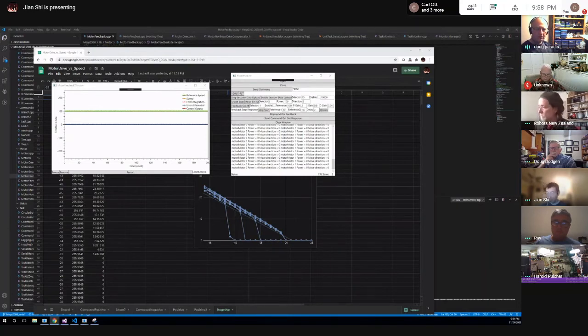So, there's nothing wrong with having four wheels and four encoders, but you're going to have a speed PID loop on each pair. Like, if you're telling the left side to go 100 and the right side to go 50 so that it's turning, you want both wheels on the left to go 100 and both wheels on the other side to be going 50.